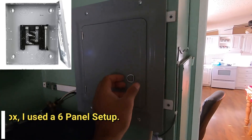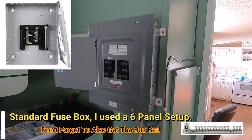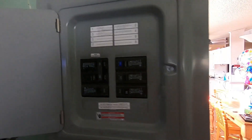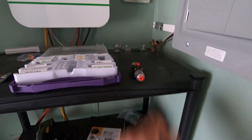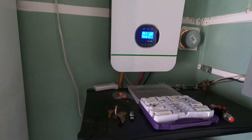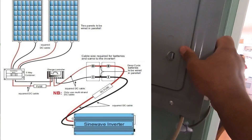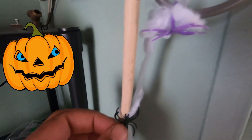That's what I upgraded from — the EcoWorthy setup that I previously had installed. I also did install myself a solar fuse box. This is my fuse system right here. I have two breakers that I'm not using right now and two that I am using. This is my breaker setup. I went ahead and hooked up a main disconnect and hooked up my fuses inline for this system. You always want to make sure that you put fuses in between the solar panels and the inverter, and also from the fuse box and from your battery bank. That's what I did as a precautionary measure and it's been working out really well.